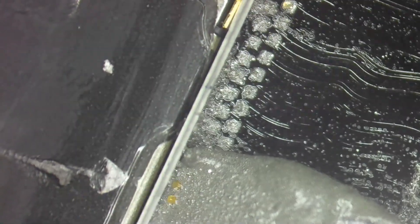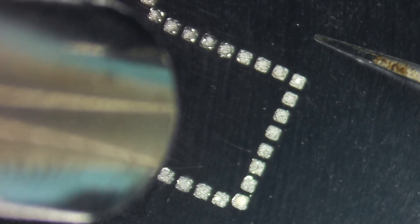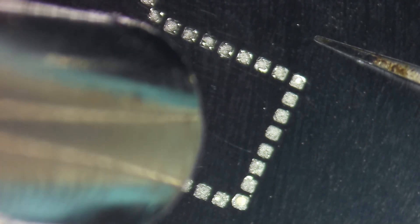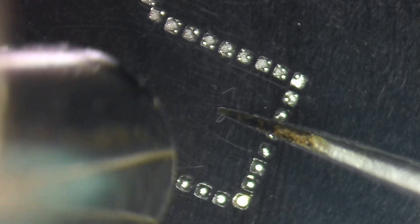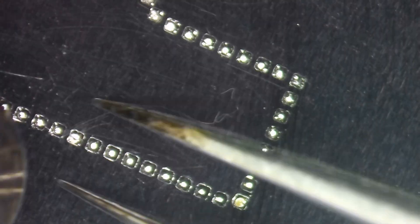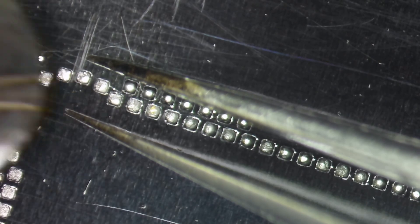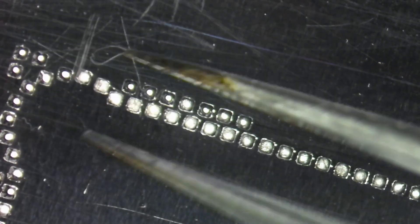I've had a few casualties here with some of them coming out. I'm going to wipe away the excess and I have enough spacers in all the crucial spots — we should be good. I'm going to take some hot air and carefully go over and create nice solder balls on each one of these joints, taking my time to go nice and slowly all the way around the border.